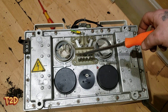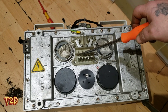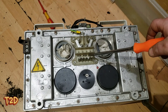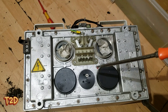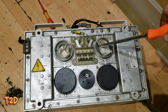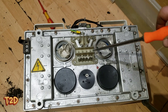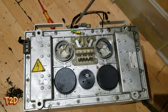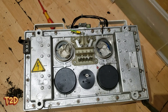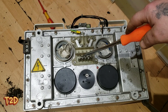These are for the actual high voltage contactors - as you can see there's three pairs but they're actually connected together so there's only three connections here. Basically what they do is activate either the front set or the rear set; the center is common. They'll put 24 volts on one side or the other depending on whether they want to use one or two machines from one transformer. They're obviously protected by an RC snubber down here at the front - there are two snubbers in there for each set. And as we spoke about before, this is the high voltage feedback and the current feedback.